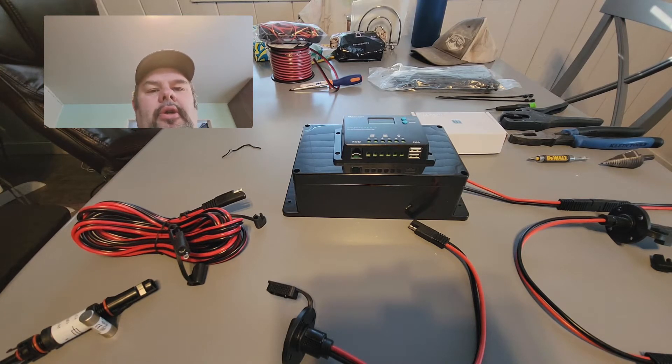These are all parts you could buy and you have to do almost no connected fittings. I had a subscriber ask me to build a solar cart for him. We priced it out and the cost of things are just kind of going through the roof lately. This little setup here is designed to hook up to a 100 to 200 watt solar power system. If you put 200 watts on this, you'll max out this controller.